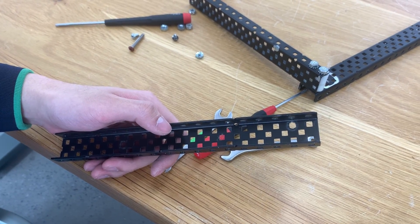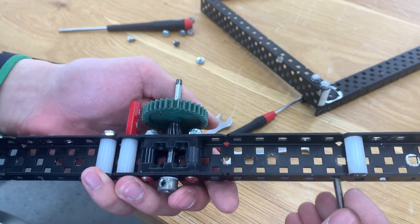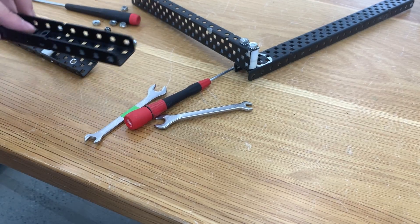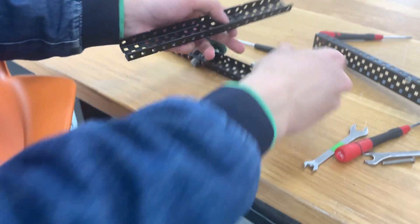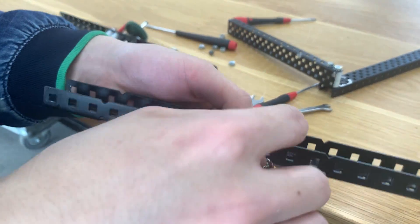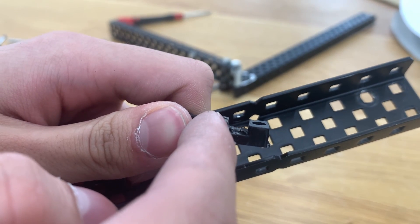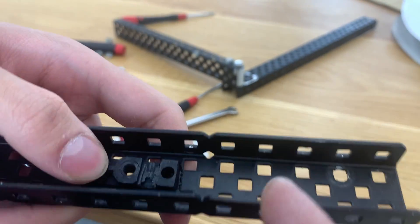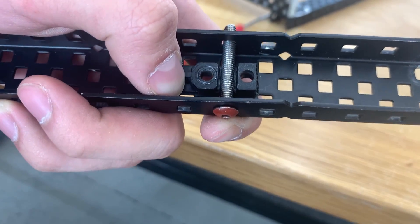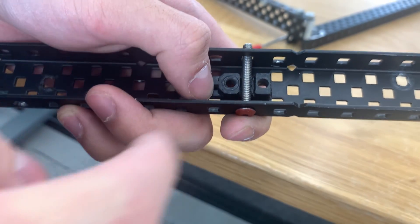Here's the advantage of using screw boxing. A screw is obviously thinner than a spacer. If you want to box something on the drivetrain where there are a lot of bearings going through, normally if my bracing crosses a bearing location with spacers I can't really box it. However, with screws I can carve out a notch — as you can see, I cut a notch here using a bandsaw, or you could use diagonal cutters. By putting this notch, I can put the screw through and place the boxing around it. Generally, if my support contacts any kind of bearing, I'll switch to screw boxing.